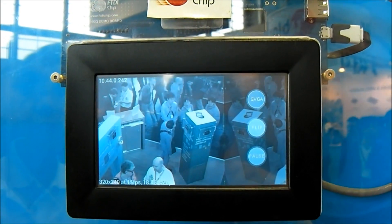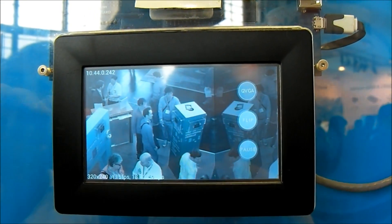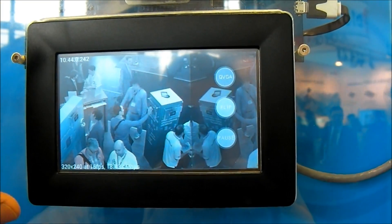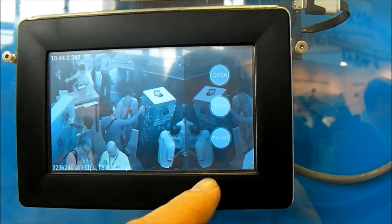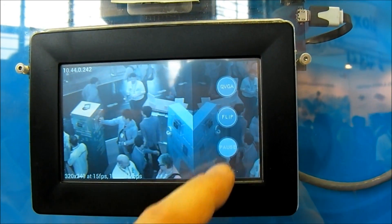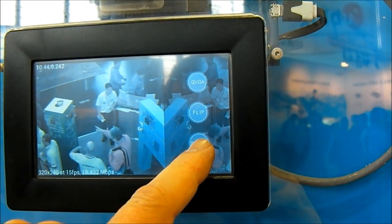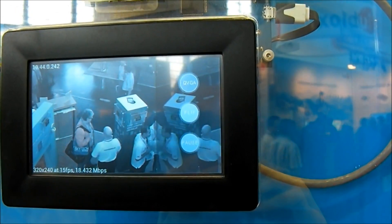Now we're looking closer at the video and you can see very distinct resolution of the picture. How we're getting that is each pixel is at 1/16th resolution. Now we have the display utilizing the FT900, giving bitmaps to the FT800, streaming video — and you can see the resolution there. The other thing to note is the control panel that we've overlaid with the actual FT800. The FT800 can do some neat things too — here we're flipping back and forth in a mirror. There's an edge here that we flip around for symmetry, and the FT800 is actually processing that image in real time and doing the flipping. We can pause it, start it, flip it.